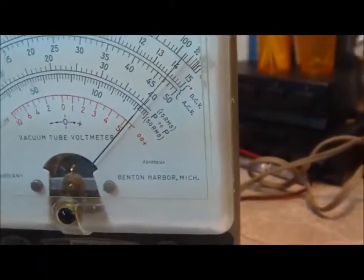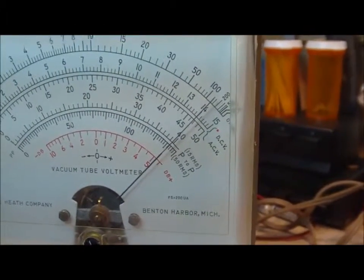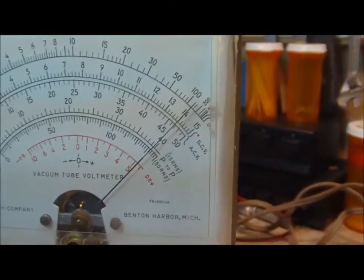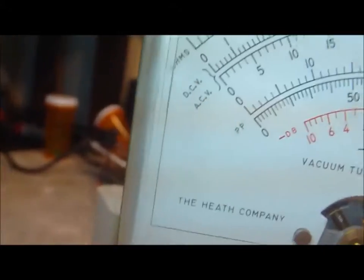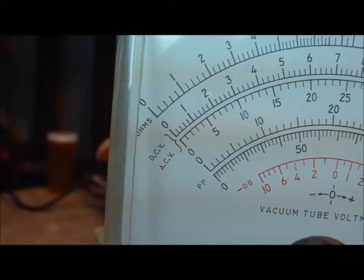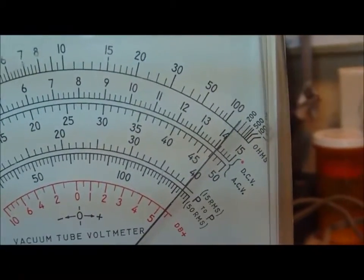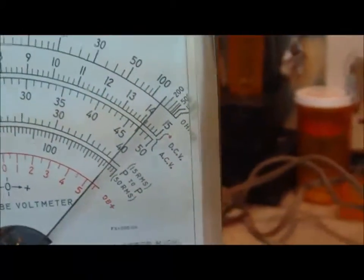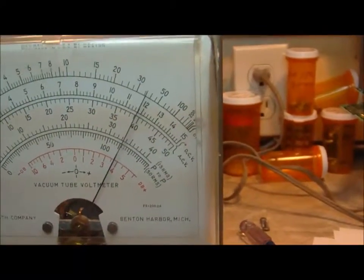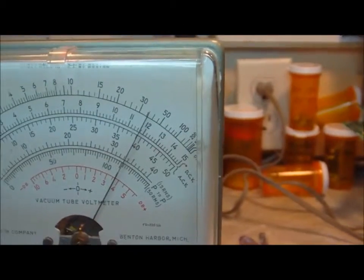I'm not really sure what I'm looking at here. According to what I think I'm set on, I'm reading around 140 volts. That's supposed to be AC volts. That scale is a 150 volt scale, so that's just a little off — we'll have to reset that. Let me check what it says to do. Now as you can see, the meter reads 118, and that's pretty close to what that one says. I'd say that's pretty much right on, so we're going to count that good.